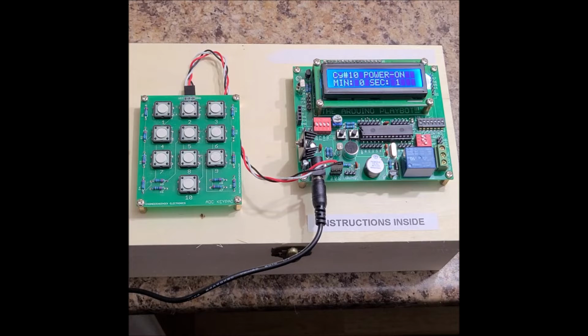And as you can see, cycle 10, power on, power off for 5 seconds. It starts counting down, shows you the actual time. And it'll just cycle on for 2 seconds and then off. So this is to power cycle devices and make sure that they're not damaged when cycled on and off for long periods of time. This helps in many aspects of test.